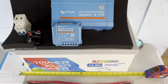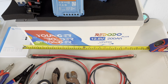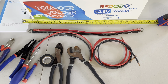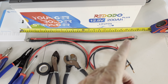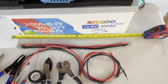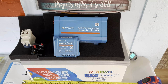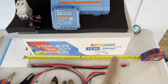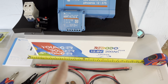I'm trying to fit this into a very small space, so what I'm going to do now is pre-cut all of my wires and hook it up initially here in the shop before I move it into where it's going to go permanently. I've got all the wire I'm going to need — some six-gauge and the rest is ten-gauge — and that's all I'll need to tie this system together. I want it to fit within about a two-foot footprint.